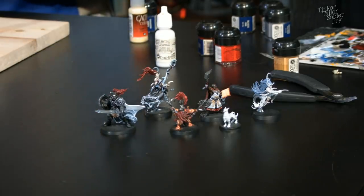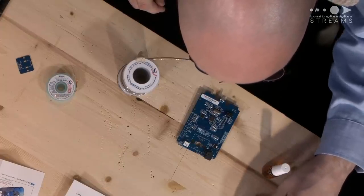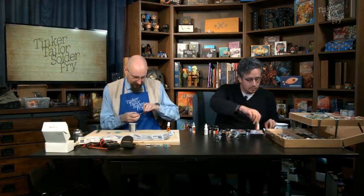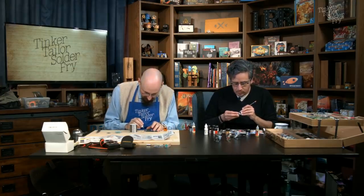All right, that looks good. I'm always worried about putting too much solder on these things, which is something I really shouldn't have to worry about. Okay, switch for power. This one will be fun because it's got 3 contacts. Where do you go? Right next to the power. But on which side? All right, thankfully that just fits in with friction. I'll just give that a good little painting with flux.